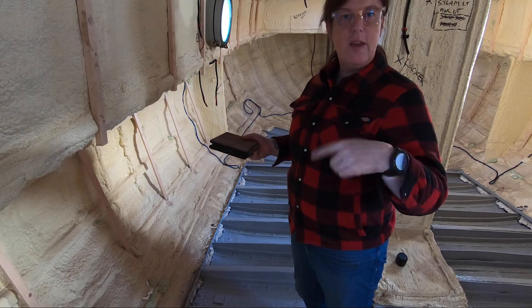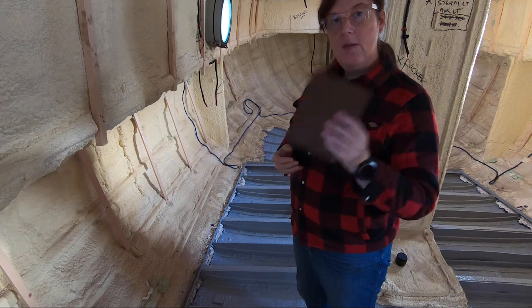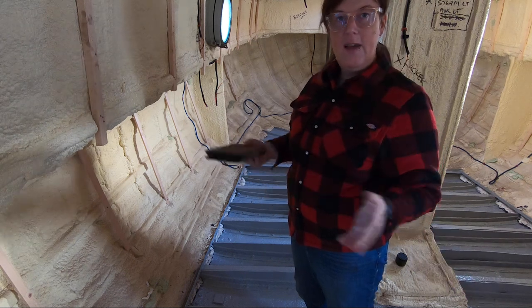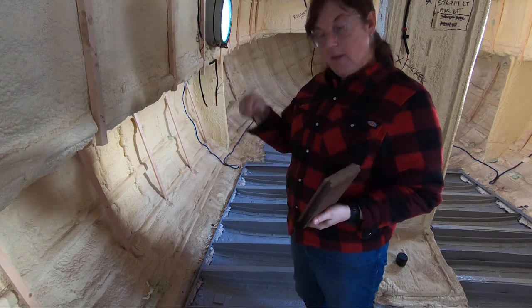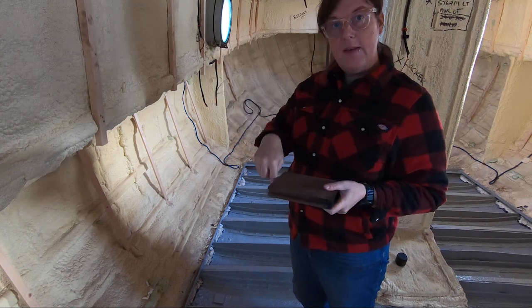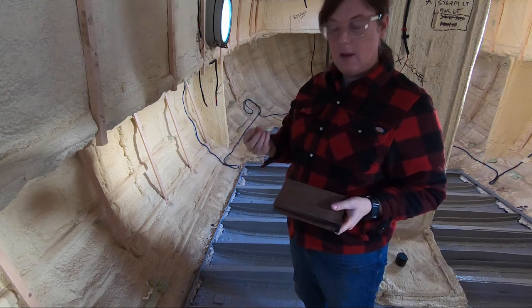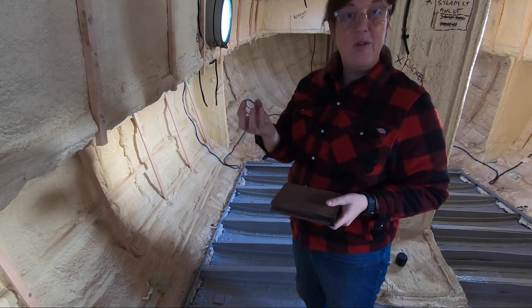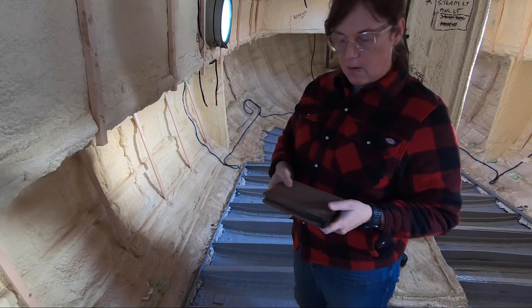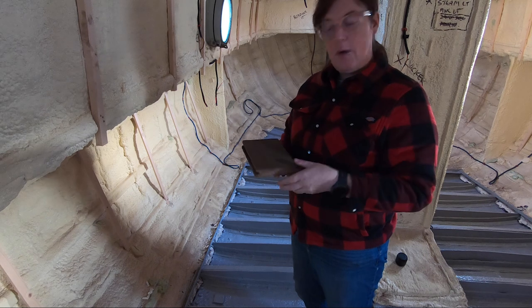So the problem is that if you're bolting or screwing metal to metal, or something hard to something hard, then that's okay. But when you're screwing something soft to something hard, the soft thing is always going to get destroyed. Especially because the screws went into the joist, and it was damp underneath and rusty, and they rusted into the joists and also became corroded themselves. So they were snapping and quite hard to take out. So we had to cut them out with a hole saw.